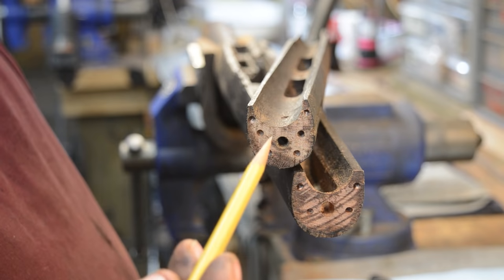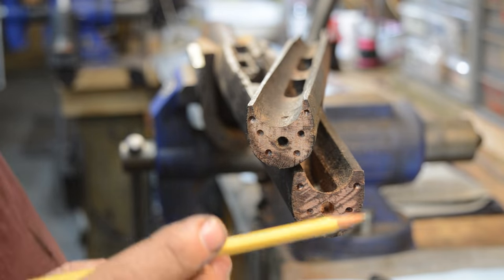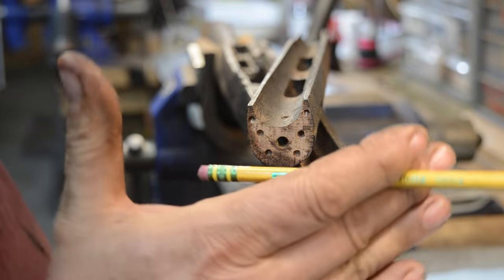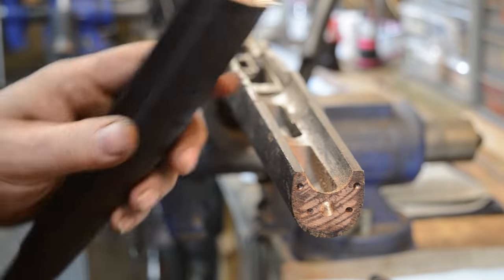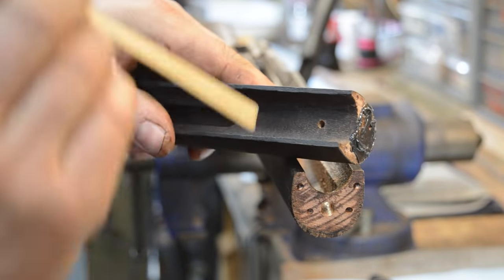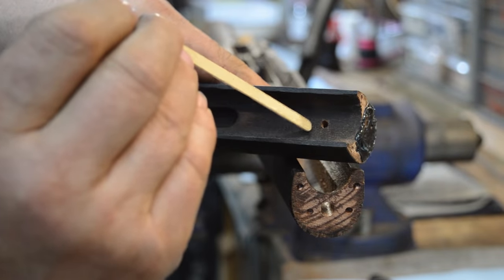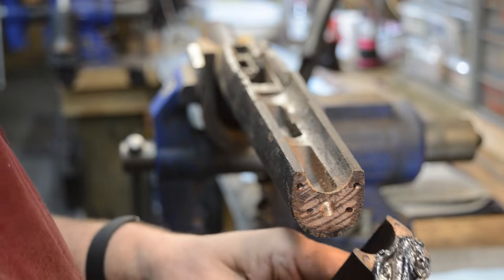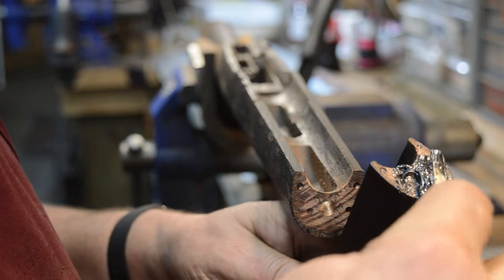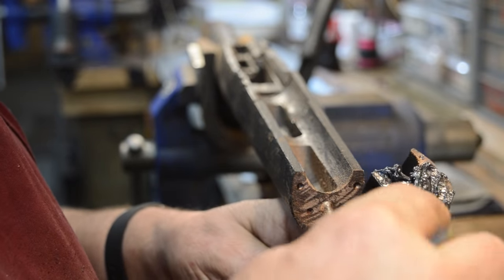We got our two through holes for a quarter 20 mount. These are just dimples that I shot in and I'll fill those full of glue and it'll give the bite and give the joint a little bit of torsion. There is a glue escape hole right here. This is air escape because I want to shove glue down the long axis of this so that that rod has a complete amount of bite. While I was prepping this, I wire wheeled that stud down shiny.